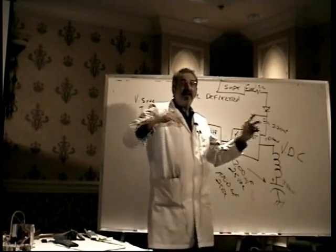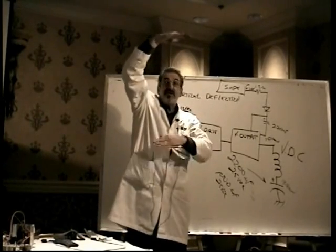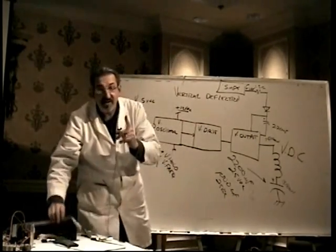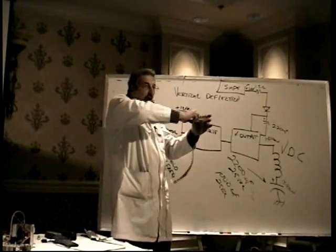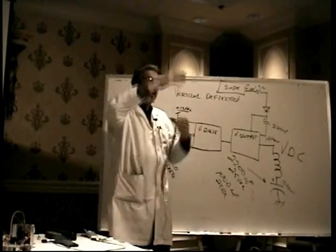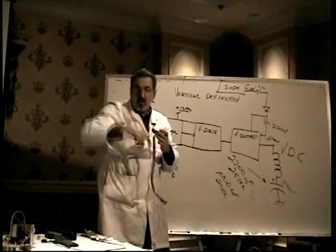When that capacitor fails, the picture starts to shrink because it doesn't have the full deflection voltage that it needs. Well, here's the insidious thing. Every time it starts to shrink, you're cranking up the height. Then it starts to shrink more because that capacitor is bad, and you crank up the height some more.